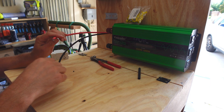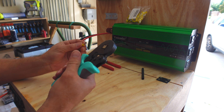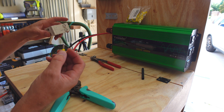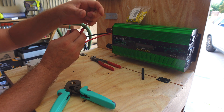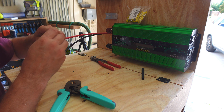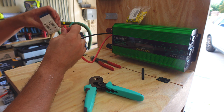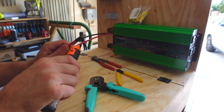For this station I'm going to be switching over to what they call ferrule terminating ends — just these little guys. It does require a special crimping tool, but this was only about 20 bucks and came with quite a few different-size ferrules. It's supposed to provide a much better connection point for these terminal types where you insert the wire and tighten it down. This is going to be my solar cable extension going into the bottom of my solar disconnect switch. You just squeeze it on, twist it on, insert the ferrule, and squeeze down — and it makes a perfect square connection.